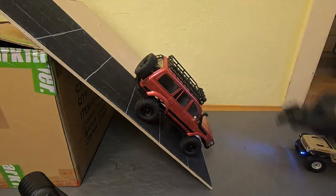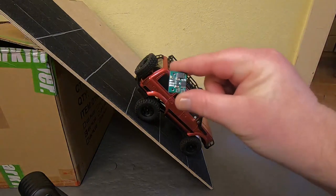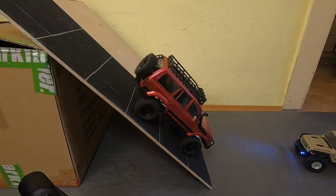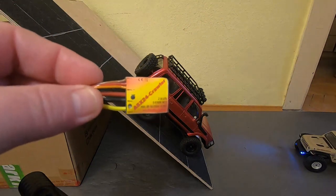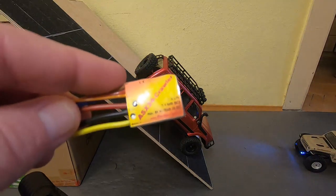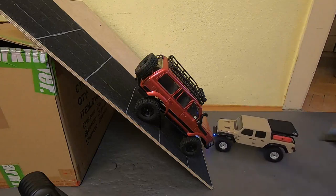So that's the drag brake of the AS126RW and the AS1215. In the new ASX24 crawler ESC I showed you some days ago, it will work the same way, even a little bit better because commutation delay is better. For me this drag brake is sufficient even in ring and pinion gear trucks, and in worm gear trucks like the SCX24, that's not a problem anyway. That's it — thanks for watching, see you in the next video.